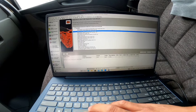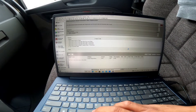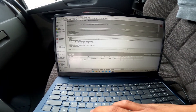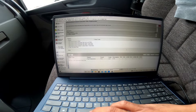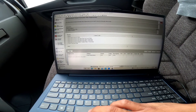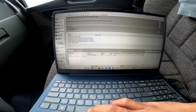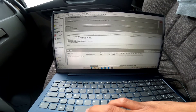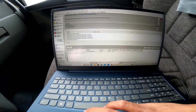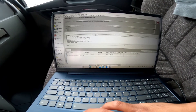Click on that, click on next. It says the after treatment diesel particulate filter regeneration can be used to clean the particulate filter of soot. Initial conditions: engine running at idle, vehicle stopped. On the monitors it has: after treatment injector status, after treatment diesel particulate filter soot load status, DPF outlet temperature, DPF intake temperature, after treatment diesel oxidation catalyst intake temperature, and engine operating state.